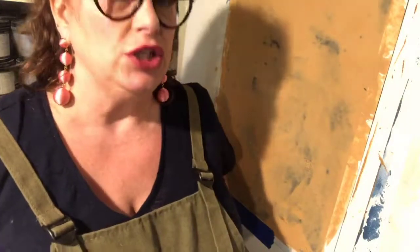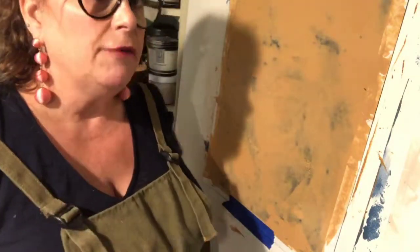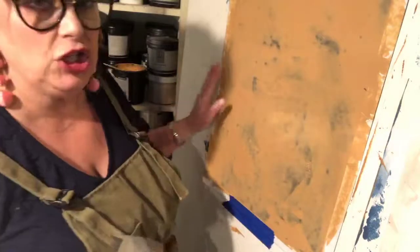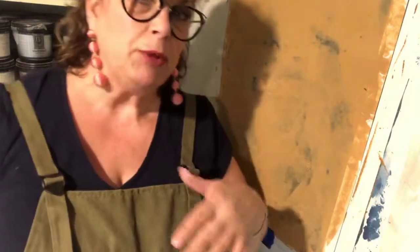What's the difference between Stucco Lux and Venetian Gem? Stucco Lux is mineral plaster. Venetian Gem is 100% acrylic, so you don't get the easy high shine the same way. Venetian Gem doesn't polish the same way, but it can be used in places you can't use Stucco Lux, because Stucco Lux cannot be sealed with an acrylic product. It is organic — it needs to breathe. It needs to be waxed or use Stucco Lux sealer. You can't roll an acrylic top coat on it. It needs to breathe, so it's not the best option in a kitchen. I know people have used it in a bathroom — I wouldn't use it in a high-use bathroom; I would use it in a powder room.